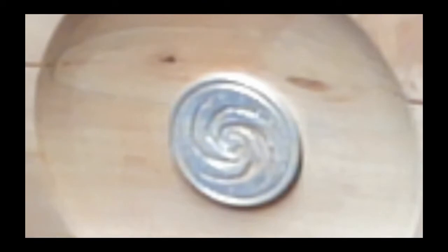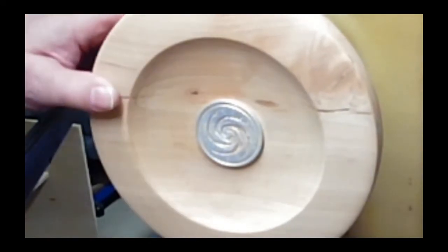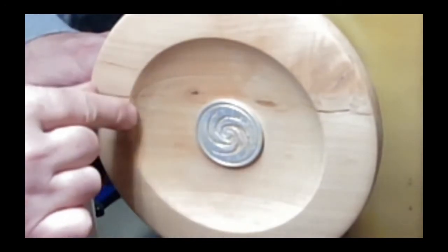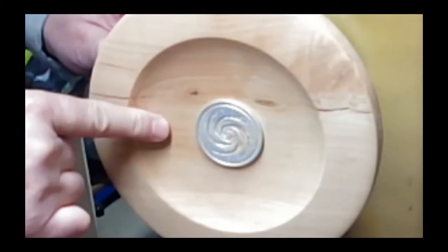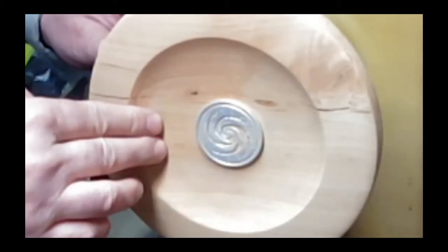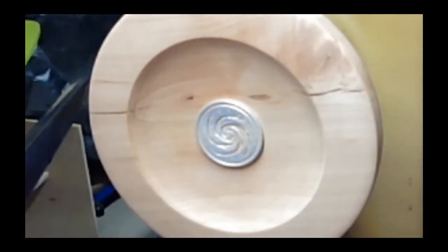I'm also going to show doing it on the face side of it, on the rim. When I plan my pieces, I plan to have a space to do my texturing in. I also plan to leave some chunk of the material here so that I can turn off any airbrushing or anything like that — any mistakes I make I've got some room to turn off — and I've got some meat of the wood to support some pressure when I apply the texture.